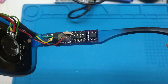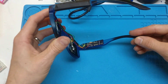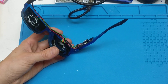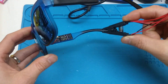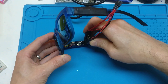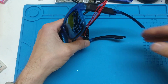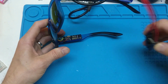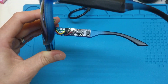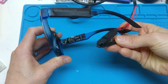Around the other side we've got an ATtiny85 in SMD form. It was quite challenging because I soldered it to the board and was like, great — and then I was like, oh wait, I've not done the bootloader or the code or anything. But I made it so you could use one of these clips to clip it over the top. It's kind of hard when you're trying to clip it on, look at the screen, burn the bootloader — you know, trying to hold it and press the keyboard. I did eventually get the bootloader burnt and the code burnt to it, so it's quite good. You can actually upload more code if you want — that's why I left it in this orientation, so it has plenty of space to just clip one of these clips on.